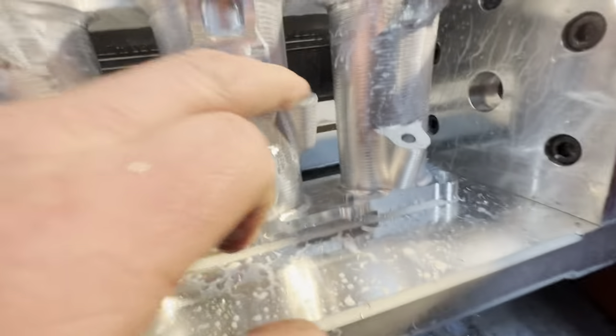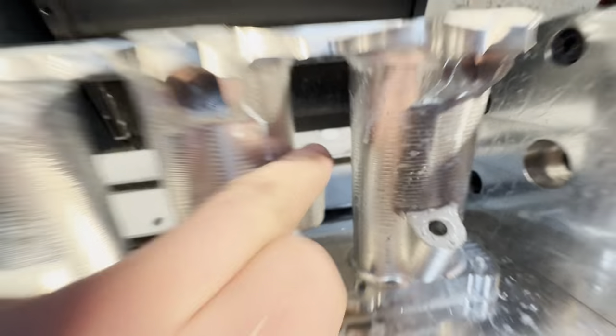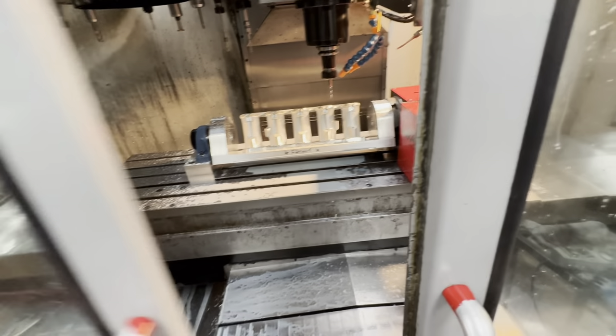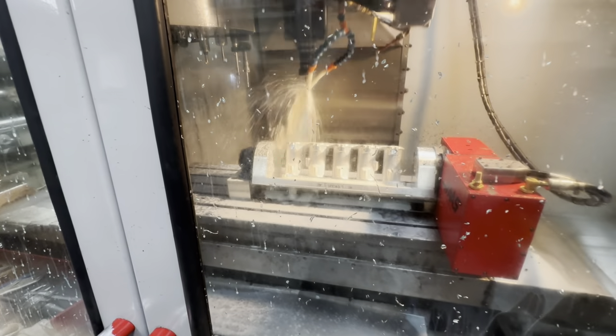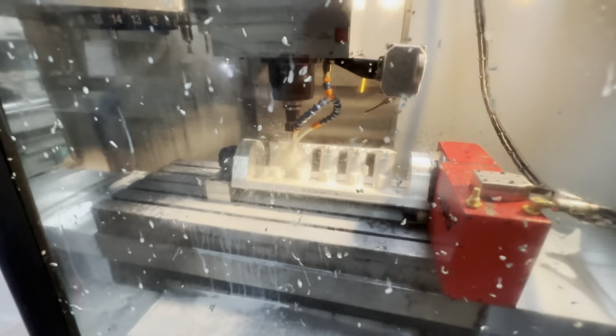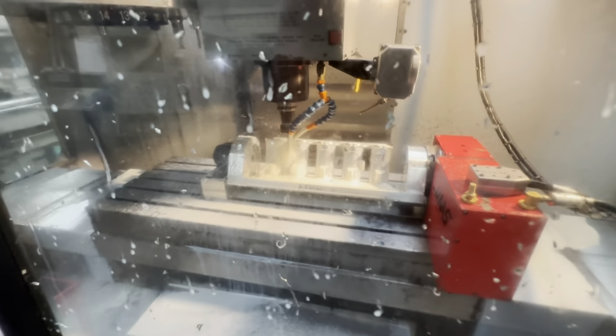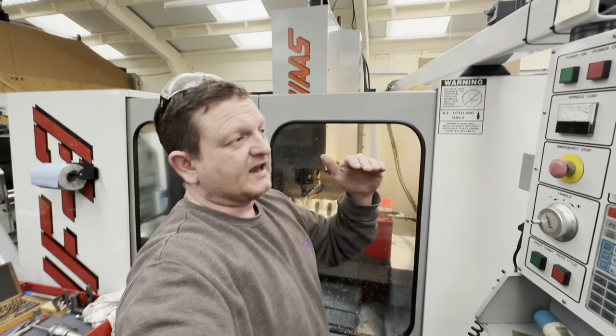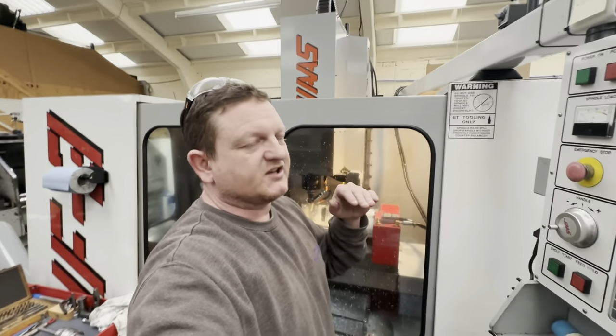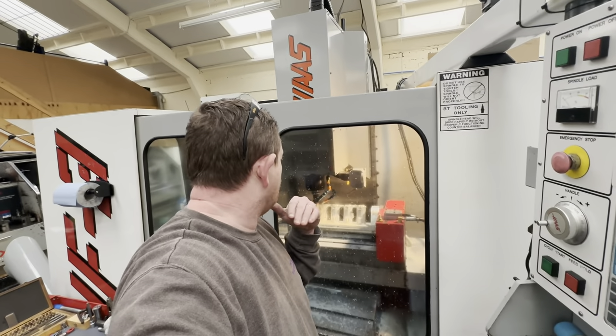Because I've already gone over with the bull nose, there's a little bit at the back — could take like 0.1 off there. So we're now going to come across the other side and let it go with coolant. We should be good. Just going to let it run — it's feeding from the top height. I'd just play it safe; I could flick the feed from say 5mm above the face that we're actually machining, but I'd rather play it safe.